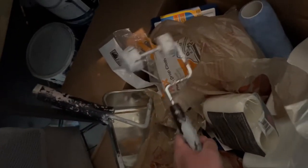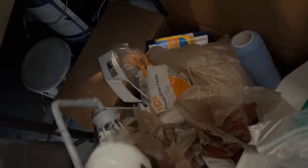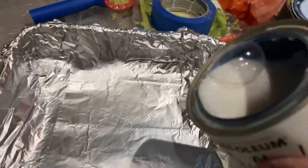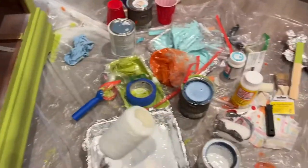I put on coats of the Rust-Oleum matte clear protective coating. I went into my paint pit and found a roller — I tried a regular mini roller instead of my fancy ones and it didn't turn out that bad. I used one of those disposable paint trays lined in tin foil to save it. I got three coats on — I coated the whole thing in the matte clear, drawers and everything, did a second coat on the top, a second coat on the drawers, and then a third coat on the tabletop since that's going to be our bar.